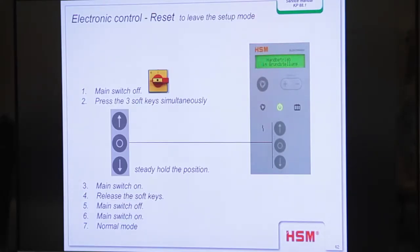The difference between this electronics and the new electronics is that here you have only one part with the touch screen and one part with the electronic board, and the display is also part of that complete part, so it's a little bit more expensive. On the new one, you have 3 single parts. You have only the touch foil on the outside. You can take it away, and there's only a flat cable to connect to the board. You also have a single display, also connected with a flat cable, and then the main board. So you have 3 parts which you can change. It can be that only the display is broken, and then we can replace just the display, or only the outside touch panel is scratched or cut off, and then you can change the pad from outside. So it's a little bit easier, and I will show you some details of what you can do then.